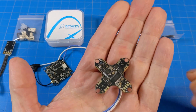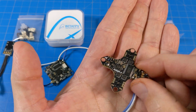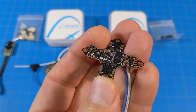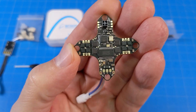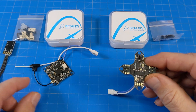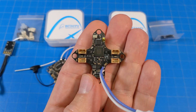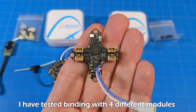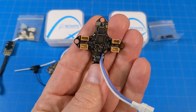In the case of this one, it is a 5-amp ESC, and you can see that little cube antenna. It really doesn't translate how small that antenna is, even when you look at some of the small ExpressLRS receivers. Many people have commented about how small they are in real life. There's no VTX built into these — you will need to add your own VTX for both of these boards, and these are also just 1S. This is going to be the lighter version, and we'll weigh them both up in a minute. This would be more appropriate for your traditional 75 or 65-millimeter whoops.